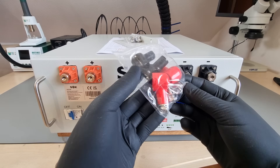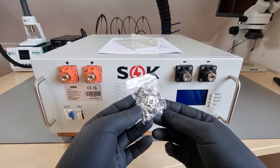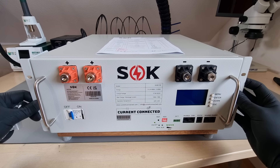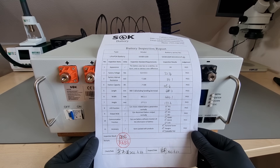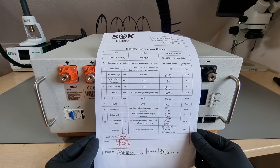This battery was delivered with bolts and shrouds for the main terminals, a rack mounting kit which we might need if I can ever afford another one or two of these. And a handwritten factory test protocol that curiously doesn't seem to mention any temperature or over-current tests. So there's something for me to do.